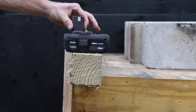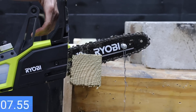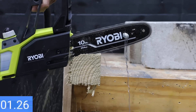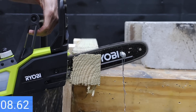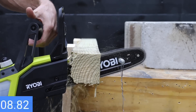I just pulled the regular battery out of the freezer. The regular battery is really struggling and the saw stalled three different times, finally finishing the cut in 15.72 seconds on the first attempt. The regular battery warmed up a little and stalled two more times on the second cut at 12.47 seconds — three seconds faster. The regular battery warmed up quite a bit and made the third cut in 9.22 seconds.